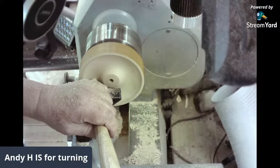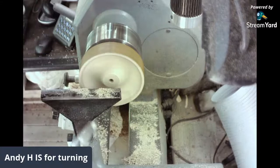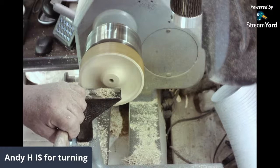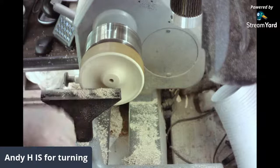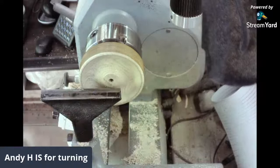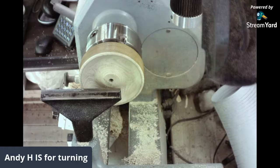We've got the boiler back, and they've done a lot of work on it, haven't they? Yeah, they've done a wet test on it, but they haven't done a pressure test, a steam test, yet. And it's all the steam tests and bits and pieces like that that really cost the money. Because you need the inspector to come down to test it wet, and come back to test it under pressure. Something like that takes 3 hours to get up to steam. So it's a lot of time involved and a lot of expense.